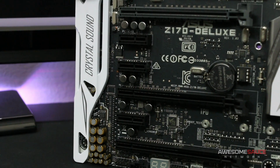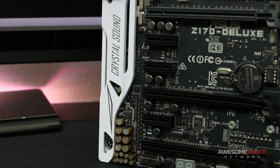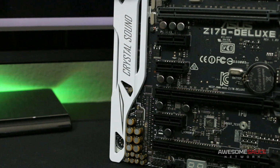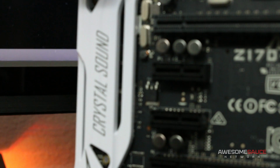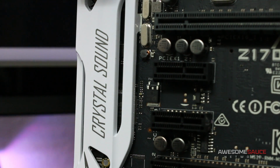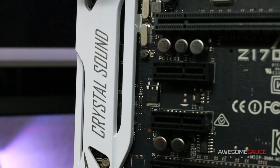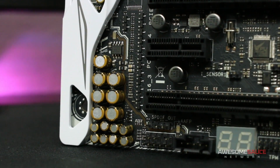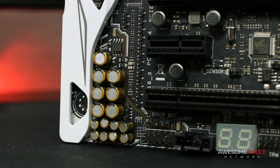To ensure a superior listening experience for users, Asus brings a number of improvements to their onboard sound chip with Crystal Sound 3. Alongside the isolated trace cutout for reduced EMI, a pre-power regulator has been implemented for better power delivery, which translates to overall cleaner audio. Noise isolation has been given a tune-up, and Japanese audio-grade capacitors bring additional warmth to the sound signature. There's also an added de-pop filter to reduce unpleasant hardware noise when booting up or shutting down the system.